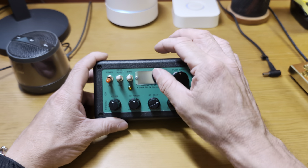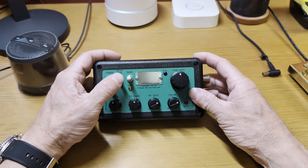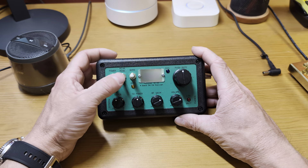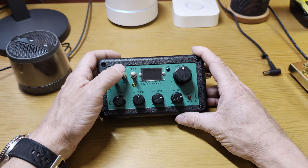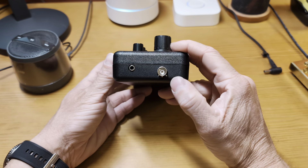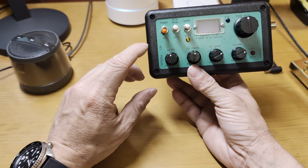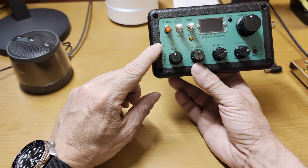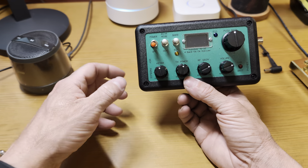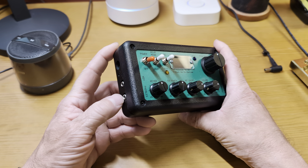It has a RIT function — a simple up switch to change band, down switch for RIT. There's a receiver mode switch to change between wide and narrow filters, and you can go really wide to listen to single sideband, though it won't transmit SSB. Down is the memory function for the memory keyer. On the sides you have a BNC for antenna and headphone jack. On the other side there's 12-volt power. One cool feature: separate jacks for a straight key and paddles. This means if you're using an external tuner, you can plug into the key jack and key down to tune without going into any menus.